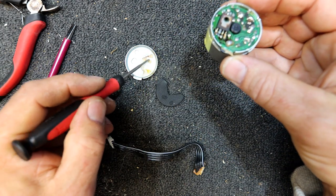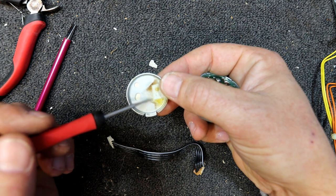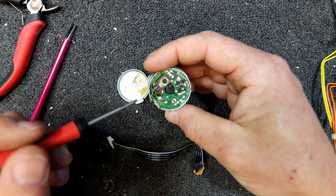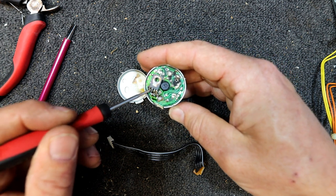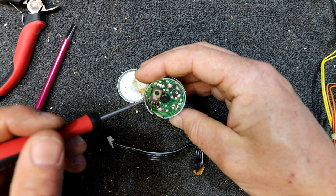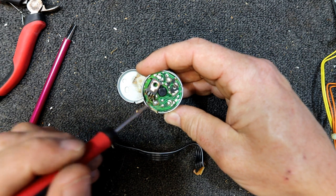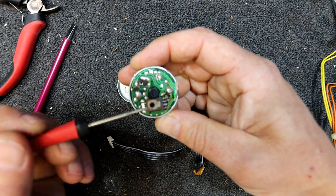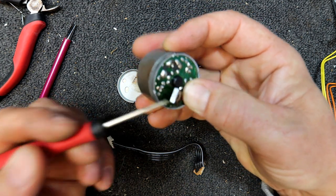Because that varnish looks like when an IC or something has spewed its guts out, you get this sort of varnishy stuff and blackened little dotty bits. That's a pretty common sight. And that pin there looks completely black. That's like solder that's been superheated and fried flux on there and stuff. That could have been the contents of the chip, but I think that chip is very strange for it to cook like that, but maybe the motor windings are gone or something.